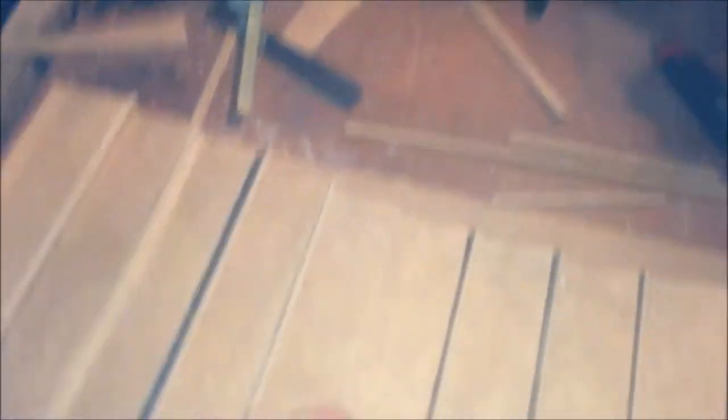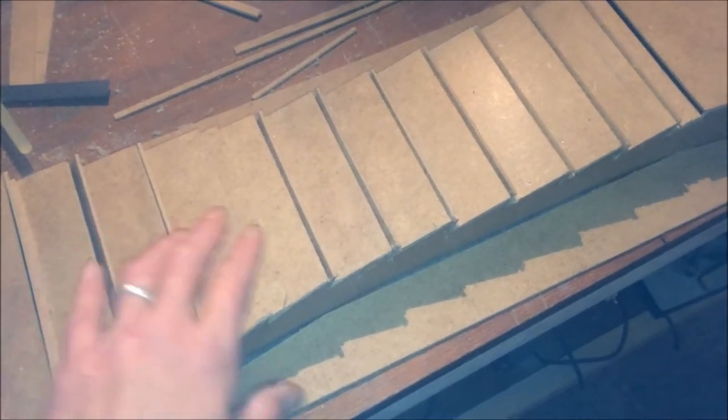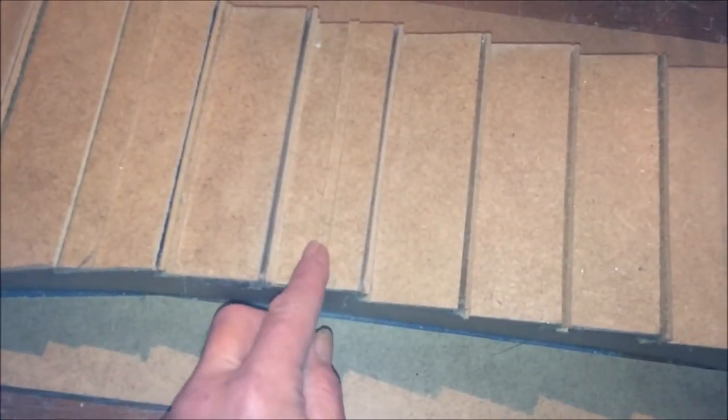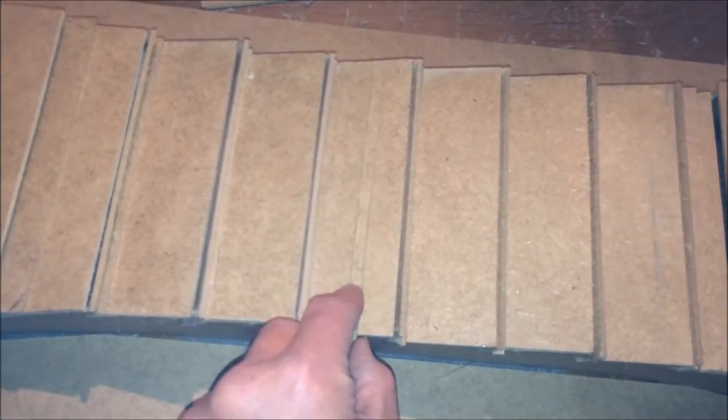Sunday morning now — I was working on it last night until about 6 o'clock and I've come back and finished cutting this morning. I've got to stick it all together now with a glue gun. That's going to be the inside and that'll be the bottom — it's reversed. I was looking at that Matt Kirk design and I've managed to get wells in it. There's a well there and a well here, so it's got four riffles. I'm also contemplating putting a few strips across because that will create another well to potentially catch the gold and the heavies. Incidentally, this is just 3mm MDF.